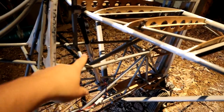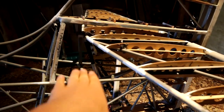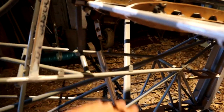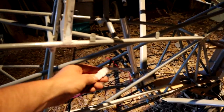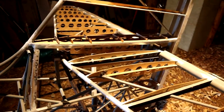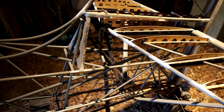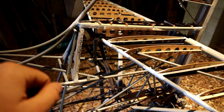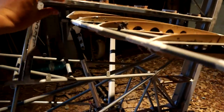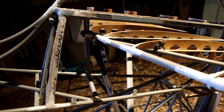There's the actual trim arm in its full extended position. This whole horizontal stabilizer flies up and down to trim, and you set it to the upper height then adjust the rod end to get it in the right trim position. To get it running you need a 12-volt battery — so I wired up the cables, got the switch running, hooked it up to a battery, and set it to the right height. The trim motor is pretty quick. I've read on the forum that some guys put an attenuator on it so it doesn't run so fast, because it's kind of hard to get it in the exact position. I was noticing that as I tried to get it to exactly 33mm spacing — I had to nudge it up, then it went too far, then back. It took a little finagling, but it's in there.